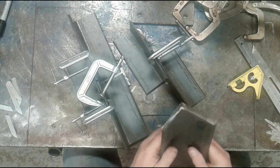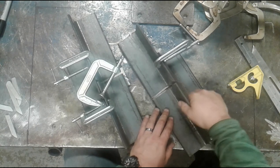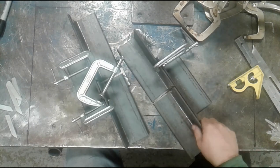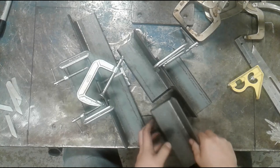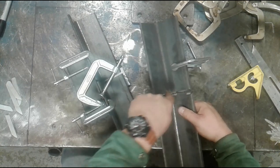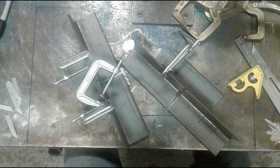My preference to beveling them on the inside is simple. If I bevel them on the inside and I weld the joint, like is shown here, then the part I have to V out is open. It's accessible. It's easy. I can get a grinder all the way across. If I bevel them the other way, I would have to somehow get a grinder in here and into the corner, which means a conventional grinder, 4.5-inch disc or thereabouts, is just simply not going to work.